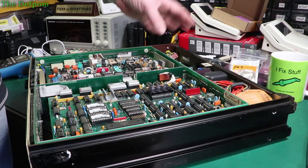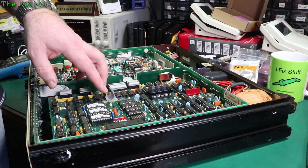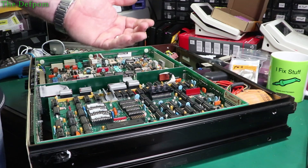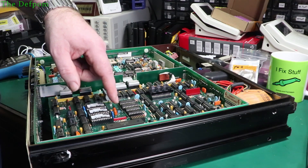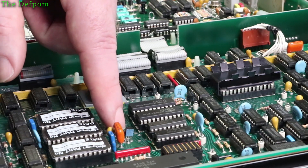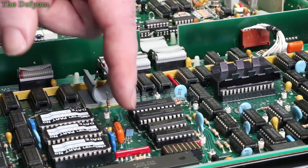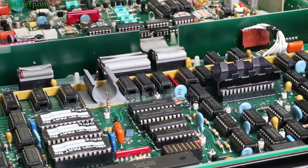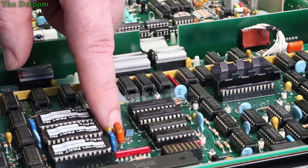I think I should power it up next and confirm what I've done works. After that, I'll look at putting a battery in, because not having a battery could potentially cause all kinds of weird issues. When it's powered up it probably shouldn't matter, because the battery circuitry goes through a diode just over here behind this transistor, with another diode in parallel. So the battery goes through this way. I haven't found a reference for the voltage yet, but it goes through a diode in parallel with another diode, which I believe is a 5 volt supply.